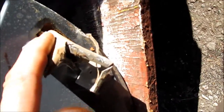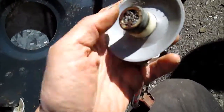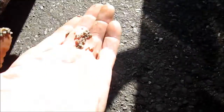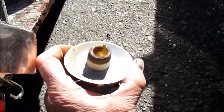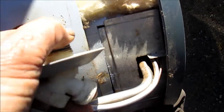You can see down here the mineral trails, signs of rust. This is the drain valve and it's pretty well plugged up — probably never got flushed. Fluoride, chlorine, and mineral deposits from the pipes get in here and cause rust basically.